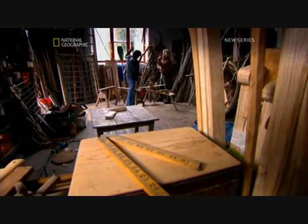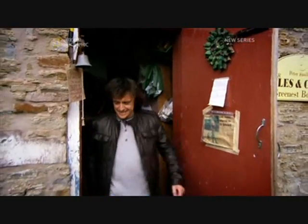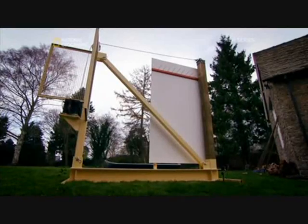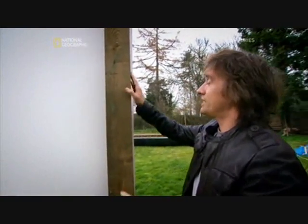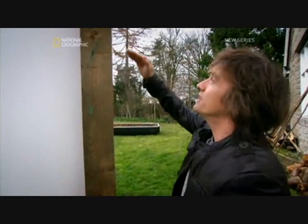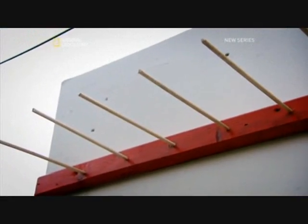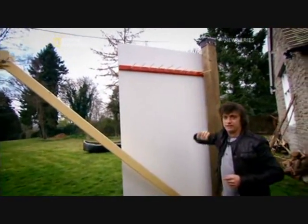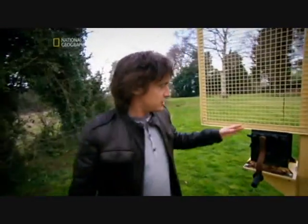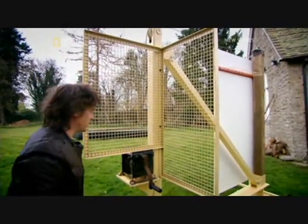I feel a test coming on with two pieces of timber exactly the same size. What I have here is my unique and custom-built flex test rig. This is one of the pillars, represented by this big chunk of wood. Proportionally, it's almost the same as the pillars, width to height. I'm going to test an uncleaved post first. I've added these straws to measure how far it will bend before it snaps. Using this winch, I will pull on that wire to apply the same force as if the road deck were expanding out this way on top of my giant pillar.